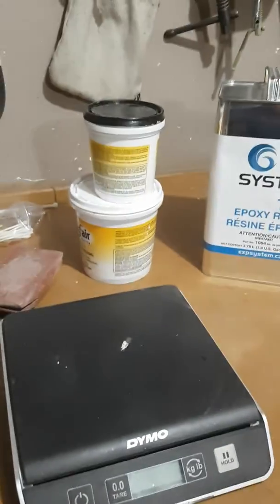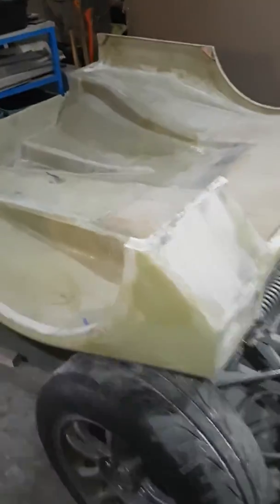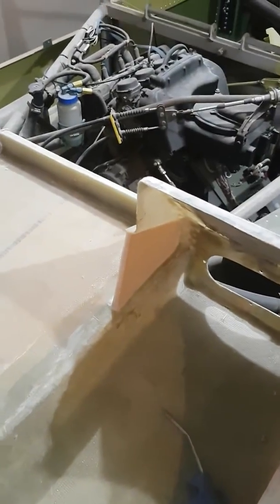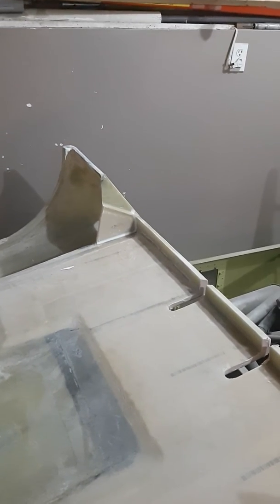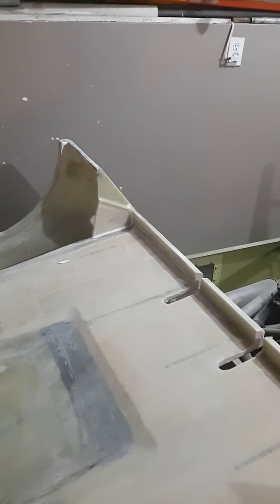It's pretty accurate. Otherwise, I've been doing some fairing on the back, and I've also made some thixotropic paste to fill in some voids, gluing some foam reinforced panels right there just to basically close out some bodywork sections that were flexing, or I intended to do it for some time now. Just ran out of resin a while ago, and added some localized foam reinforcements right here.